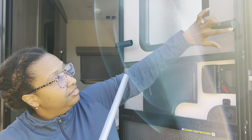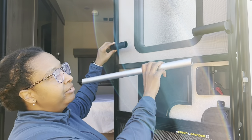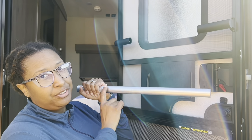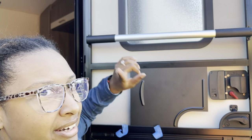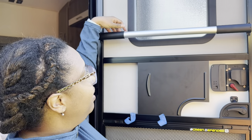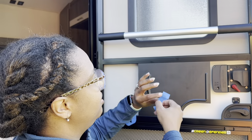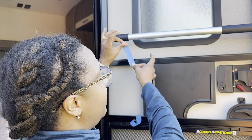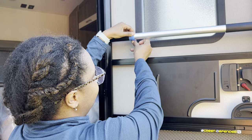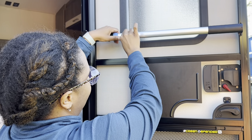I've gotten these four holes drilled into my screen door. Now I'm gonna have to take at least one of them down to get the bar in the middle, because I have two more holes I have to drill for the set screws. I've taken it down, put the bar in, and have it back up here. I centered the bar so I can see on the back that there is metal behind each of these set screw holes. Now I'm going to put painters tape on it so that it doesn't move when I take it down.